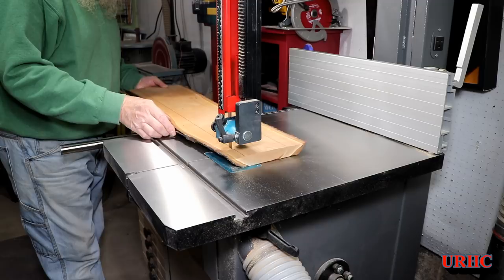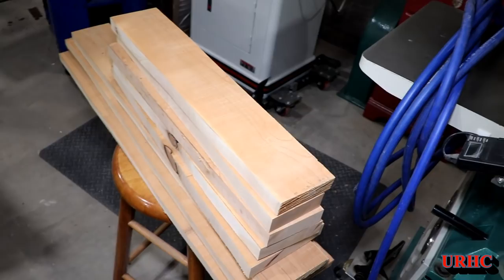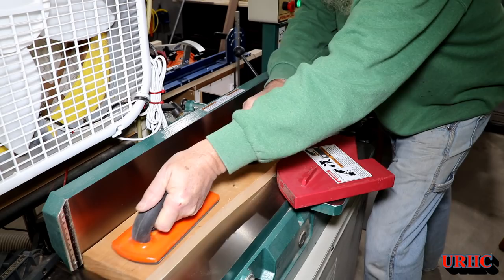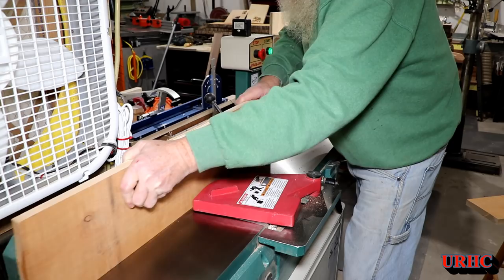Now it's time to go back down to the shop and prepare more cherry lumber for all the tongue-and-groove material that's going to wrap around the pedestal bottom and the sides of the cabinet. I'm cutting the live edges off some slices, then getting one good flat surface on the jointer. Some of these pieces have a little warp or bow — that's what happens when you cut and dry your own wood. Once I got one side flat and a straight edge on each one, I headed over to the bandsaw to resaw them down to the thickness I needed.